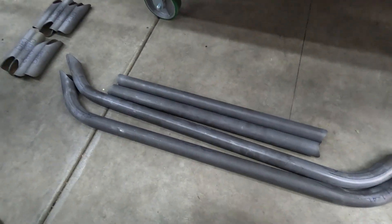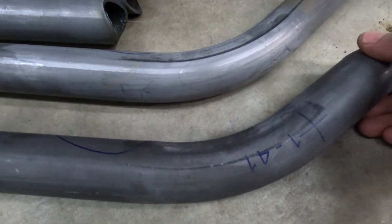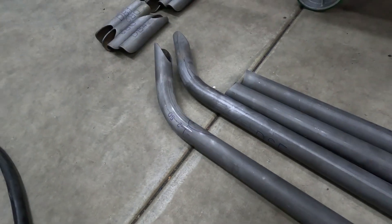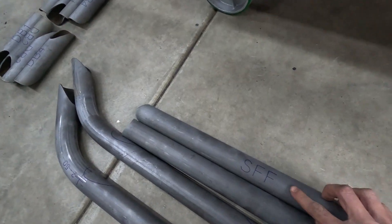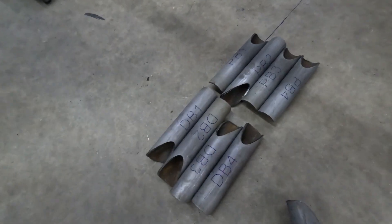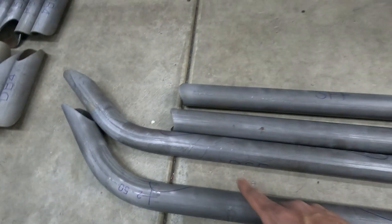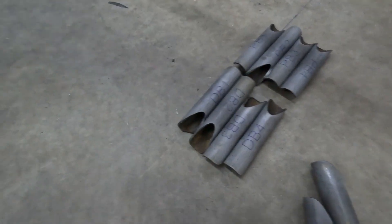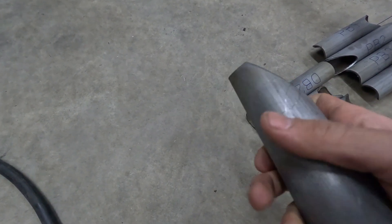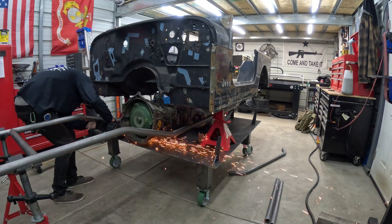Alright, we made it back. So these are the subframe tubes that I cut out. The Dragon is a super nice tool to have — it notches the tube, it marks out the bend lines, and it also marks out all the junctions of the other tubes and where they land, so it makes it super nice for assembly. I mark out what the tube is: subframe front, subframe rear, and all the little brace pieces that go in between the upper frame rail tube and this lower subframe. Got all those cut out. The Dragon is a plasma machine so it leaves kind of rough slag edges, so I'll go and clean all those up.